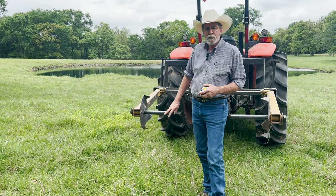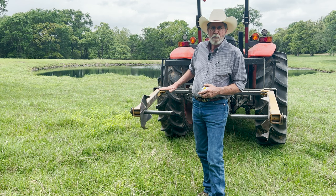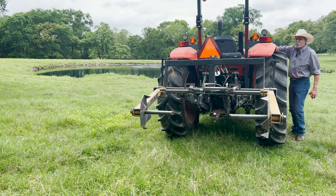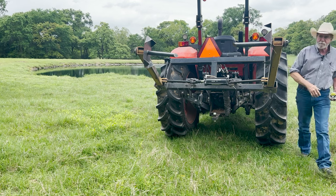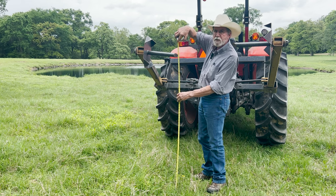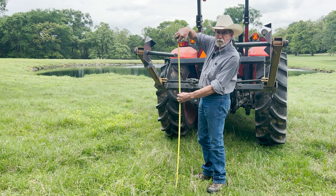The original height of my ability to lift those bales was insufficient. Adding seven inches by tightening the top link was still insufficient. Now with the hydraulic top link, that has made all the difference in the world. The center of the bale is now 54 inches off the ground — up from 40 and three quarters — giving me so much more clearance. There is no bale anywhere that I can't get off the ground if I grab it in the center.